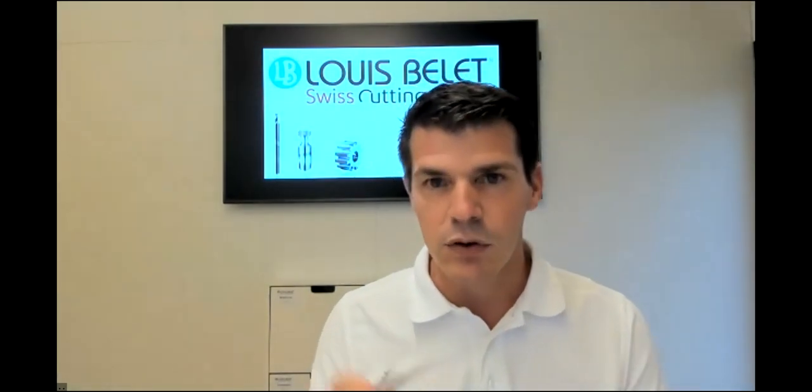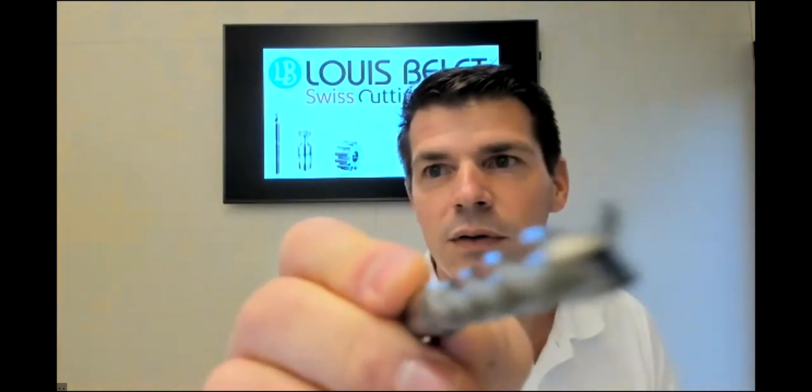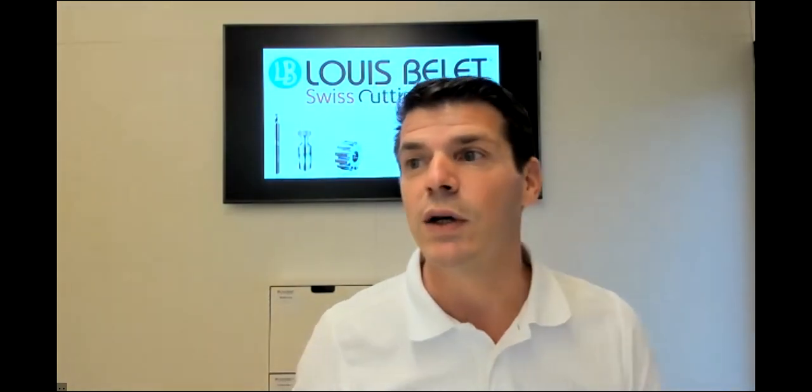But answering the question, does it perform really well in large diameters? Yes, as said. So this one is an 8 millimeter. Oops, I don't know if you can see it. Well, it's not perfect, but yes, it's an 8 millimeter drill. We go up to 14 millimeters. We also did that with bigger diameters, and it was performing well.